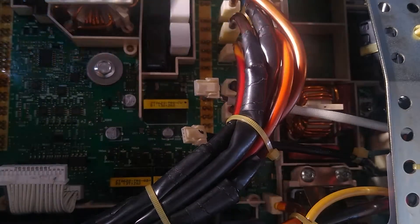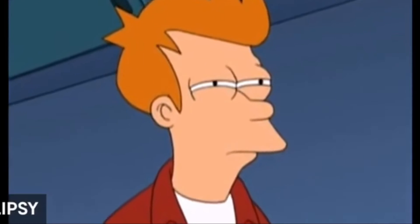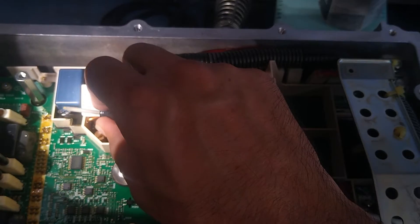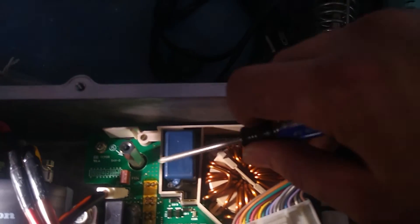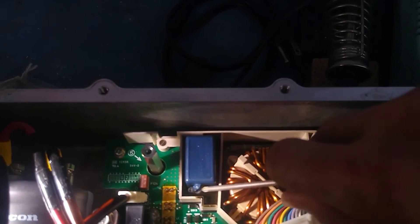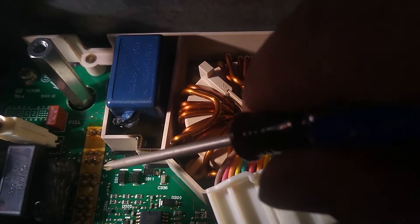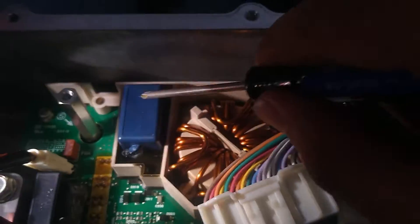After hours and hours of looking, I did see something weird. What is this nub here? Let's get a closer look — on the back side: smooth on this side, smooth on this side, smooth... and then what is this bulge? I don't think that's supposed to be there. I'm going to call it — I'm going to say that is a bad capacitor. This one is labeled LE335.